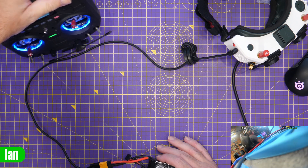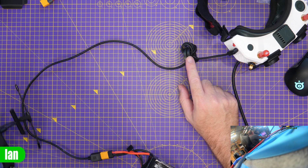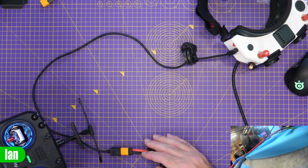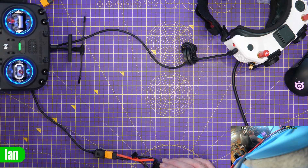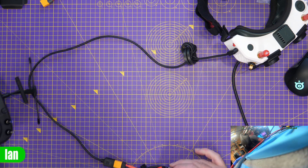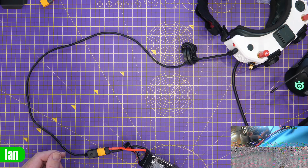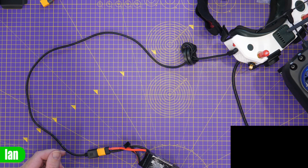Exactly the same cable. So it's clear that having some ferrite beads on the cable definitely has an effect. It doesn't solve the problem of bringing Crossfire too close to the goggles themselves — this will only solve the problem on the power cable. If we come in towards the goggle, you will see it starts to have an effect, and if I get too close it will reboot.